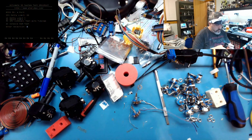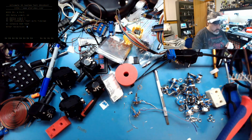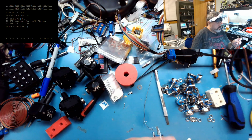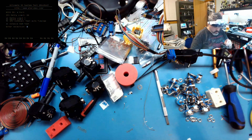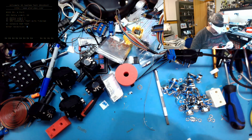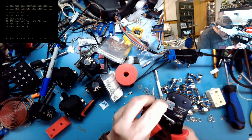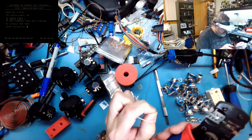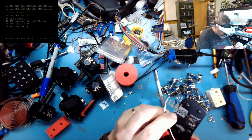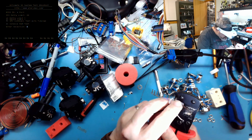This is the crimper. Shooting for a 0.3 square millimeter crimp. Kind of get in there a little bit. Doesn't matter which one I was going to do though. This is the X. Done these so many times, I memorized the colors. Black is X. In the original 5200, the wiring, ironically, is black as well. I did that on purpose to remember.